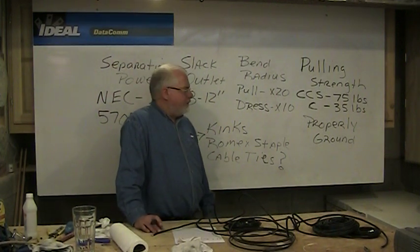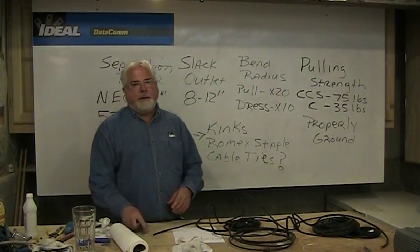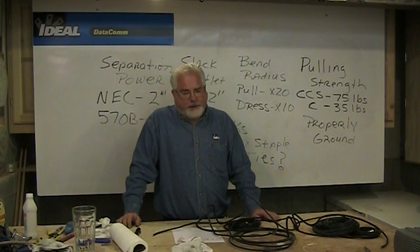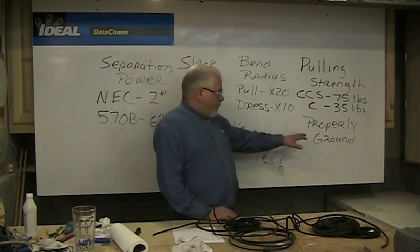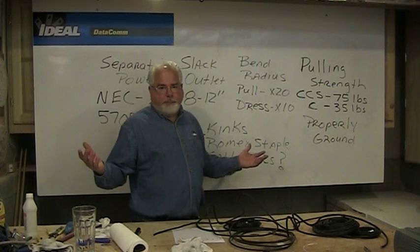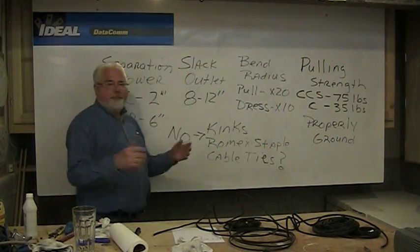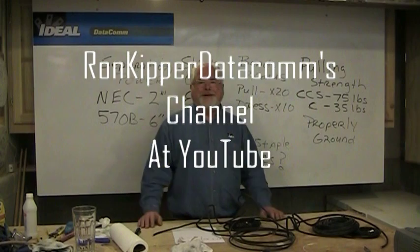The last thing is properly grounding systems. The number one cause of bad grounding in buildings is loose connections. You should occasionally go outside and tighten that lug that the cable system or satellite system is attached to — nobody does that — or go inside and tighten other connections and look for corrosion. Bad grounding causes bad video. By code in the National Electric Code, you need to ground all these wires as they enter the building. Today we have several different types of grounding bridges that may be utilized on the side of the home, or you can go out to a ground rod on the side of the home. Thanks for coming to another segment of Terminating Low Voltage Wires. I'm Ron with Ideal, and we'll see you next time.